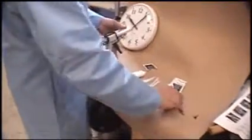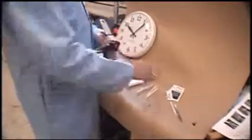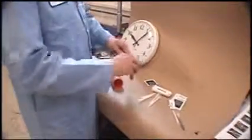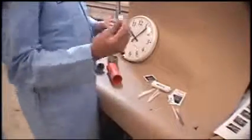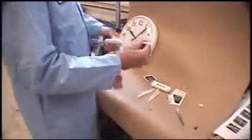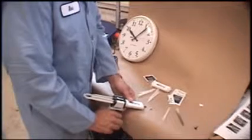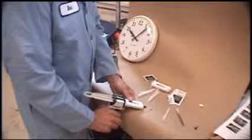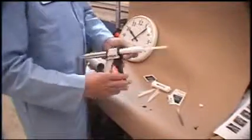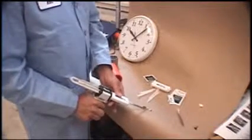For a new cartridge, we'll demonstrate that too. Pull that back and slide this in. Take off the tip — this piece can be thrown away. Before you slide the tip on, prime the cartridge. One side will be overfilled compared to the other; just keep pumping until both start coming out. Then they're ready and you put the nozzle on. Now pump up the nozzle and it'll come out a uniform gray.